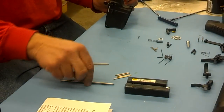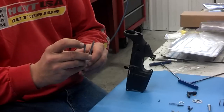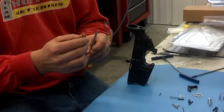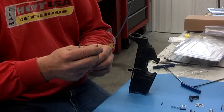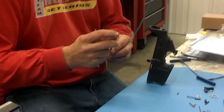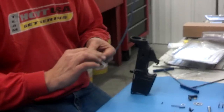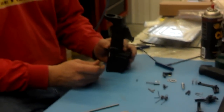The tool kit also comes with a starter punch. It's basically a tapered punch with a hole in it for starting the roll pin. And then we have a finishing punch with a nipple in it to keep everything aligned so you don't scratch the boss around the bolt catch.